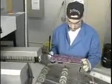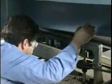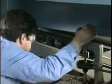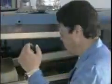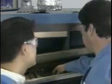If the soldering has been done properly, then the entire production run can be started. If there's a problem, adjust the settings as required. If the next run is not satisfactory, then notify your supervisor or process engineer.